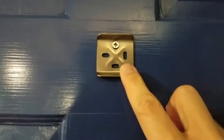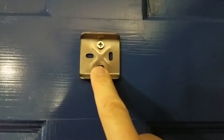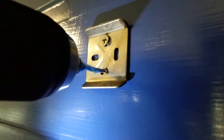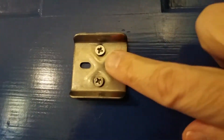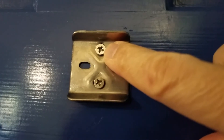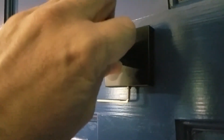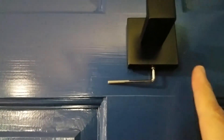It made a difference. Satisfied that it's hanging straight, I'm going to drill a hole here. I'm thinking two screws is probably more than plenty for what this is going to hold — like a jacket or something. Precaution has to be taken when using an impact tool that you don't damage the screws, because the torque is so much higher that it can start to deform the screw heads. With our second screw in, we take our hanger with the Allen key attached and simply place it over the top, catch the bottom, and start going left to right until that Allen screw goes in far enough to keep it from coming off.